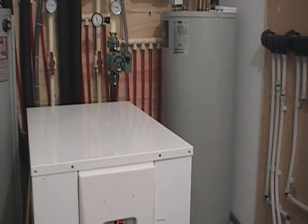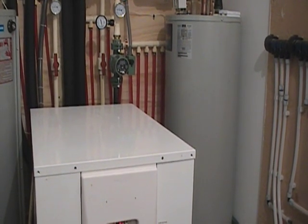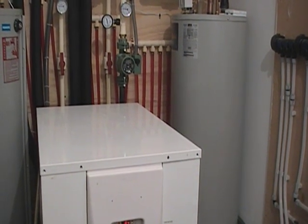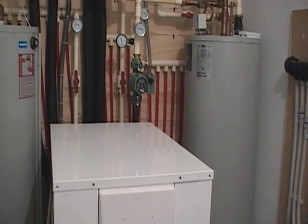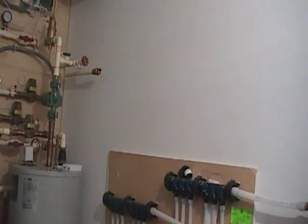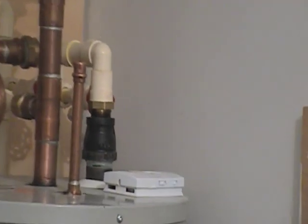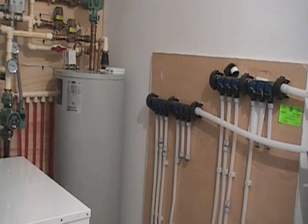This system was shut down last night. We had the heat set at 63 degrees and with the solar energy coming off the windows, the house went up to about 67-68 degrees yesterday — the heat never kicked on all night. We're going to be putting a couple of solar panels on the roof. We have another hot water tank for domestic hot water being installed here, and this wall will be covered with pumps and exchangers. We're going to take the heat off the solar array and dump it into this tank through that valve — that's where we'll be running solar hot water. Whenever the sun's shining, we'll be maintaining this tank so the heat pump never actually kicks on.